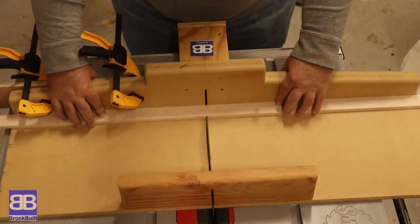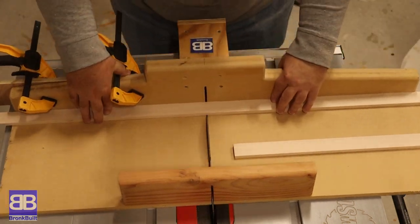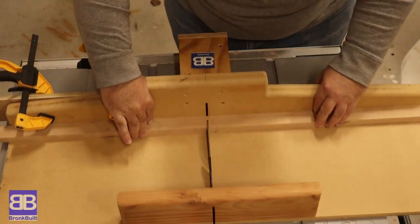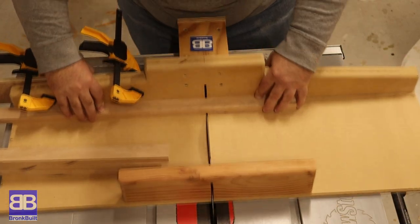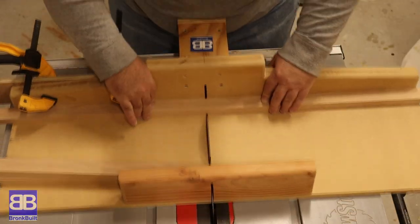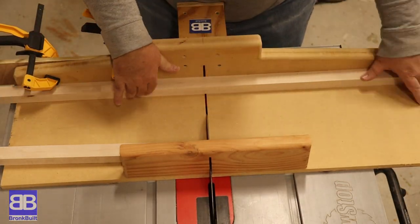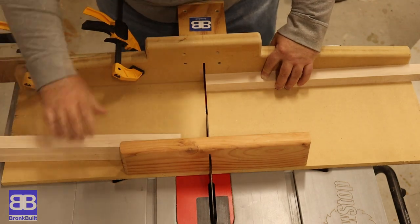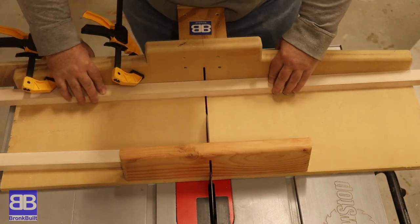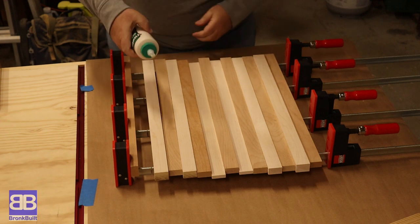Things so far are going great and it's time to cross cut the pieces to a rough length. For this board, that's about 19 inches. I'll leave two boards a good 7 or 8 inches long with a surprise feature later on, so don't leave me yet or you'll miss the surprise. If you're paying attention and looking close, you'll see the different thicknesses of each board as I'm cross cutting with my table saw sled, which is yet another video you should go and watch if you haven't seen it.